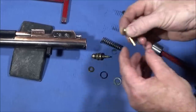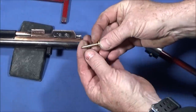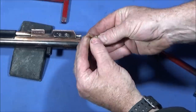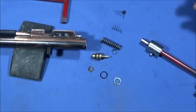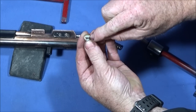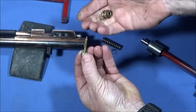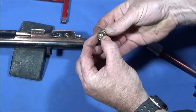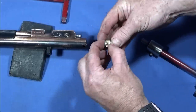And if you watch my other video on the Setra, I explained how I actually made the center part of the valve. That's this one here. This was a rubber one, and I've changed it. I made a new one, and I've put a PTFE seal in that one, and I lapped it into the valve housing, and that one does actually work perfectly.